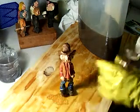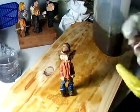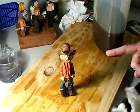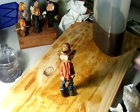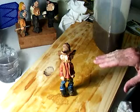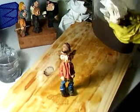Once again, boiled linseed oil is very, very dangerous. Do not keep this in the house. With the paper towels, I wet them and lay them out to dry. You can see how it changed the whole color — it just smooths the figure out. When you're through with that, hit it with some Deft wood finish, but let that dry for about 24 hours.